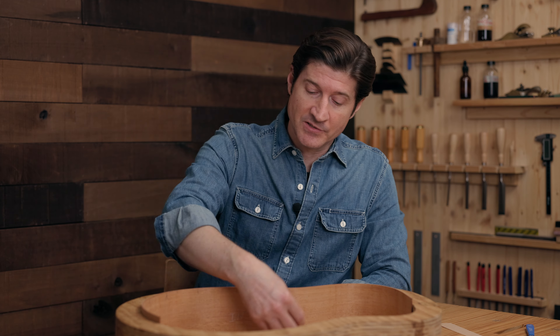There's a little bit of tension that can be okay — the wood is going to relax and things will be fine, so you don't have to freak out too much. But this was a case where it was too extreme and it was going to load too much tension and stress into the wood, because the wood wants to return to its actual shape, and its actual shape wasn't yet the shape of the mold. If I had forced it, that tension would have stayed preloaded into the cells and the wood fiber, looking for a way to get relieved.